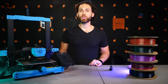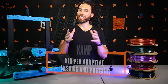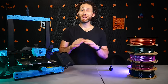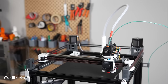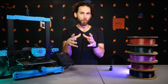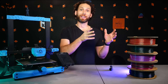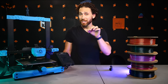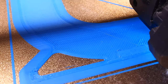Now that we have Exclude Object installed, we can add the next game-changing upgrade that depends on it, and that's KAMP — Klipper Adaptive Meshing and Purging. I first learned about this amazing upgrade from Daniel over at ModBot, and I'll link to his full explanation video and tutorial in the description below. Basically, KAMP allows your printer to do a more focused, detailed bed mesh and purge only in the areas that will actually be used during that print. This means less time meshing your entire bed, more density of the meshed points — therefore more detail — and all around better, more reliable prints.